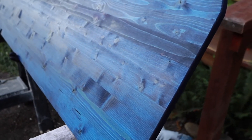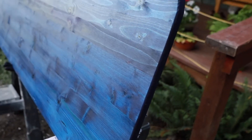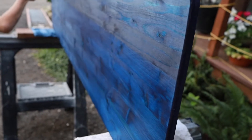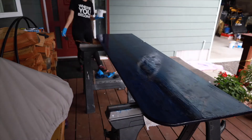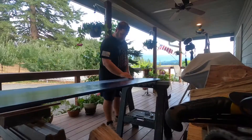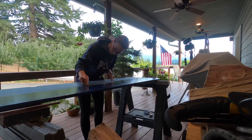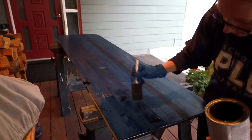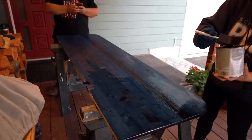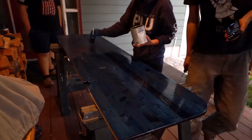It'll lighten up a little when it dries all the way — and honestly, that's fine. After we were done with the staining, we put the polyurethane clear coat on. We put a couple of layers on, let it dry, then used steel wool to take off just a slight layer, removing all the extra bumps to make it nice and smooth before adding another layer. The layering process and letting everything dry and cure can take a couple of days. This project is not something you want to do if you are under a time constraint.